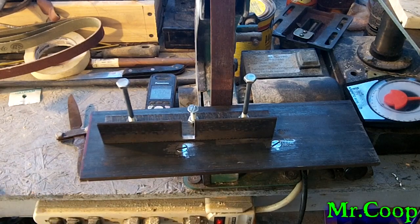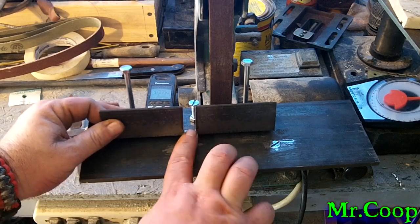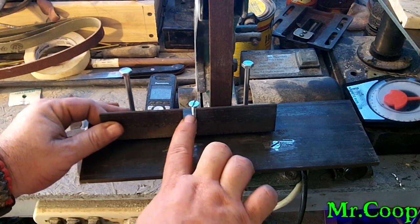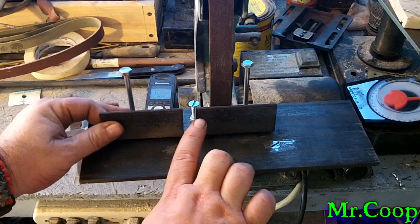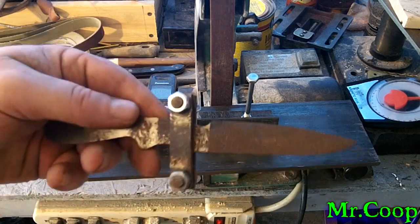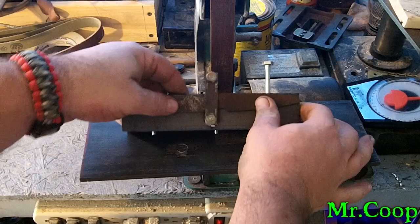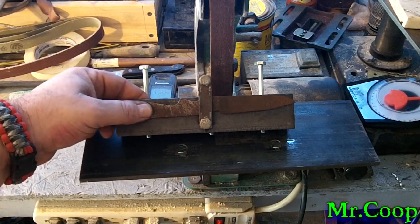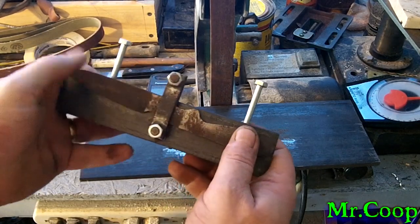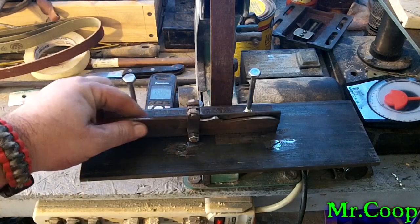I just modified my jig a little differently from the way he does it. He has his with two holes and puts a plate across that his knife sets in. I changed mine up — as you guys know from watching my other videos on my wooden jig for putting edges on my knives, I had a slot cut out to hold my guide. I figured why not do that here and save having to drill holes all the time. So as you can see, I put the jig on my knife and it slides right down inside and locks. All I have to do is put a clamp on one side, and when I go to remove it, I just take the clamp off, turn it over, spin it around, and it's ready to go on the other side. It keeps everything nice and straight — nothing moves — and it does the same on both sides every time.